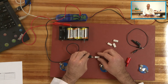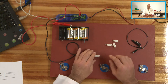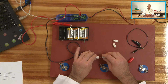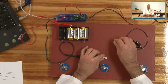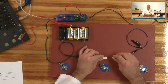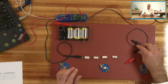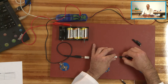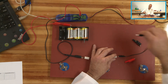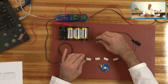I'm going to attach my first resistor — my resistors are all 10 ohms. From the diagram we need another three resistors, so I'm going to attach the three resistors quickly, also in series, making sure there's a connection between them. Then from there we need a connecting wire to close the circuit from the last resistor towards the negative terminal of the battery. I'm not going to connect it just yet because I'm going to use this as a switch.